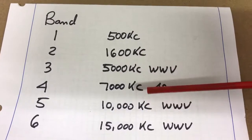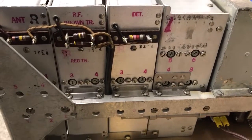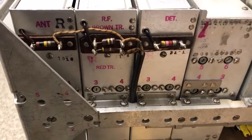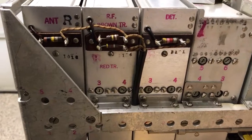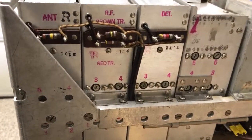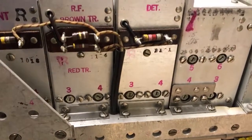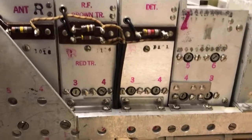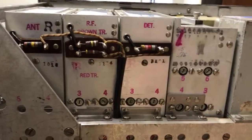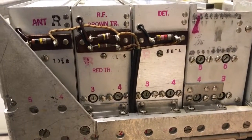Then we're going to do a touch-up on the antenna connection, antenna trimmers, the RF and detector for each band. So what you want to do is go to band one — the manual wants you to use the high side of the band. You dial up to the high side of the band. You don't need a signal generator to do this. All you need is a simple, cheap voltmeter. I use an AC voltmeter like this to peak the audio. So whether you're listening to a station or just the noise, go to band one and adjust screw number one for the antenna, RF and detector on the high side of the band. And then you're done with band one.